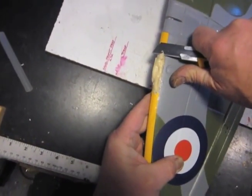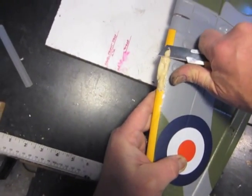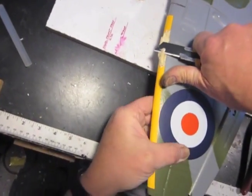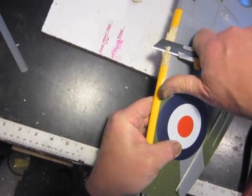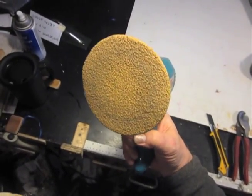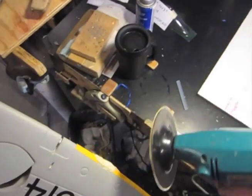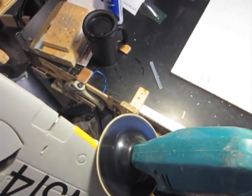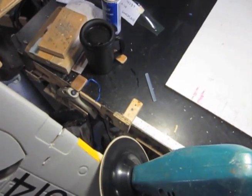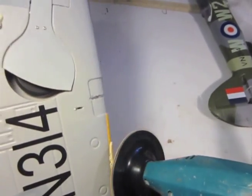We're going to shape it generally by cutting off the big, huge lumps. You can also just sand these right down, especially if you have some wildly intense sandpaper on your disc sander like I happen to have right now. Just remember, if you're going to put 40 grit sandpaper on your disc sander, be careful what you wish for. So I'm touching this very lightly. So I'm taking the big lumps off first.